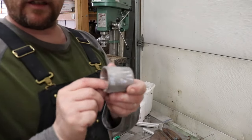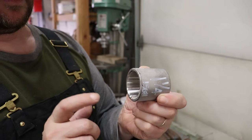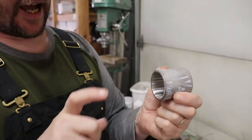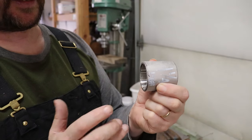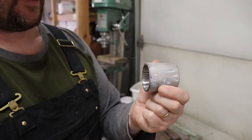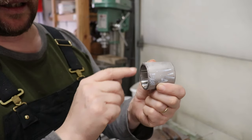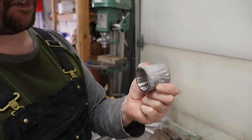And then we also have our drain line. And this will allow us to hook a water line through one side. It's actually just gonna be some electrical conduit for the outer shell of it, and then we'll run PEX through it. That's gonna protect that pipe. Not that it really needs protection in the shaft alley, but it'll help protect it from freezing. We'll probably insulate it. And then if we ever do have a problem with the pipe where it needs to be replaced, we can easily pull it out of that conduit and run in a new one. So just kind of some forward thinking on that.